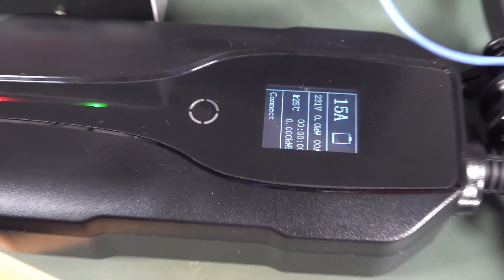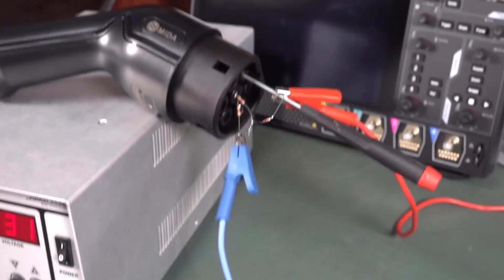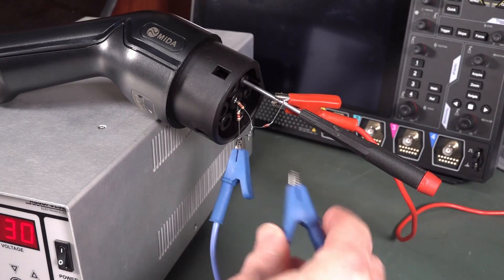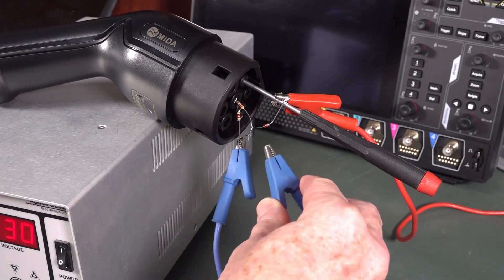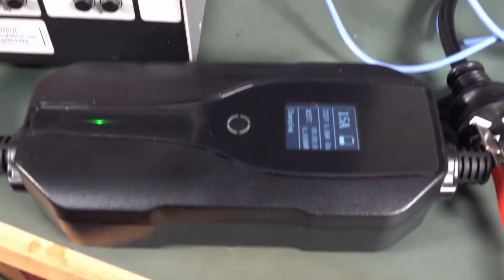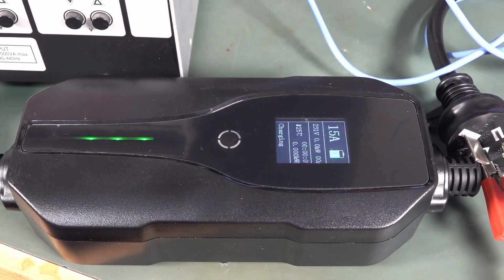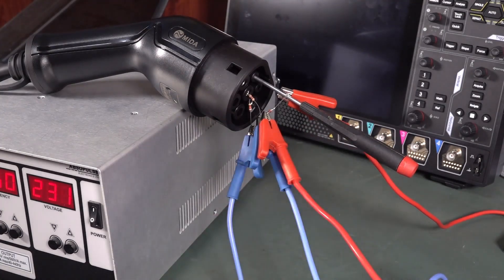Is it connected? Yes it is — winner winner chicken dinner! But it's not actually starting the charge current yet. To do that we have to put the car — well, this stuff is normally inside the car — to make it switch through we have to put a 1.2K in parallel with it. Boom, I heard a relay switch and it's charging. There you go — no worries. Well, it's not charging — it's switched the AC through. Works. And I want to see what happens if I imbalance the thing with the diode here — will it disconnect?